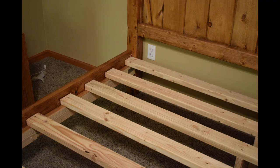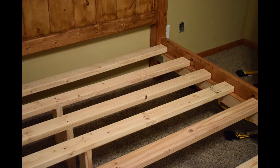And a few photos of the finished product here. As you can see, I just used 2x4s as the slats to hold up my box frame. And you can also see that I screwed some 2x4s into the middle of the slats downwards, instead of running a support beam down the middle. I found this to be a lot easier.